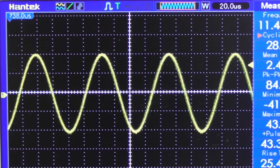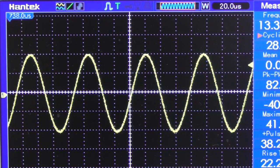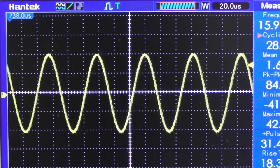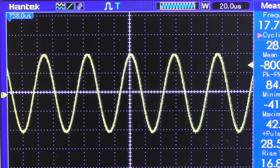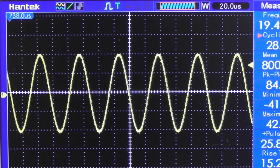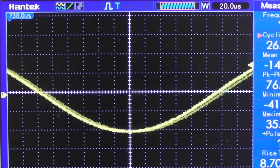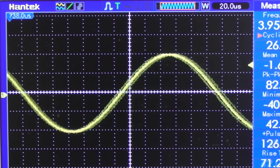Now they are electrolytic, and I suppose in an ideal world you would use Mylar or something along those lines, electrolytics being generally frowned upon in audio paths, but I've modified one of them, and it doesn't measure any better, and I certainly can't hear any better. But if you want to be accurate, I suppose you could put a different capacitor in there. So basically all my problems with it before have gone away.